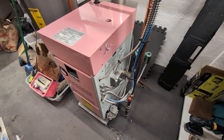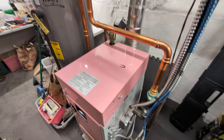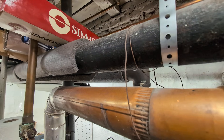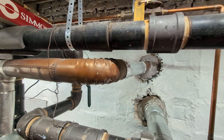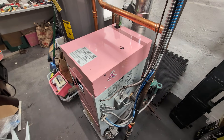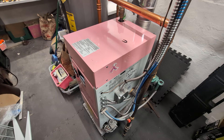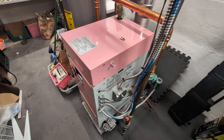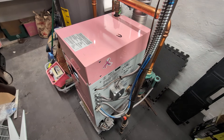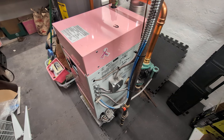This replaced a big old oversized oil-fired boiler on a gravity hot water system. You can usually tell it's gravity because the pipes are very much larger than usual. When you attach a relatively small boiler onto a gravity system, you've got to deal with a huge amount of cold water that could potentially come back and cause the system to not heat as quickly as it should.